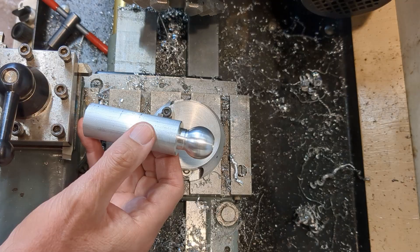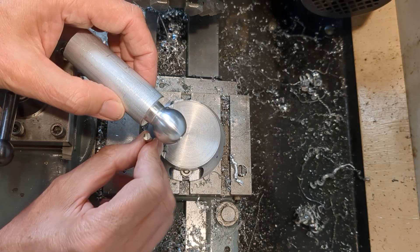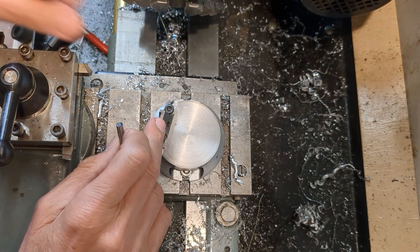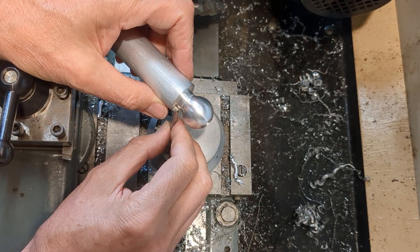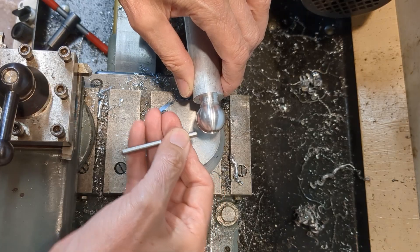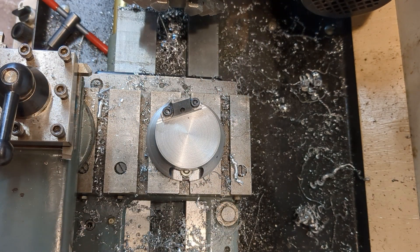What I'm thinking about now is a tangential tool holder — an alternative tool holder to be mounted here where, instead of holding the tool like this, the tool is held underneath. That will enable me to get into much tighter spots. So what I'm going to be looking at in part six is an alternative tool holder that can hold the tool at a suitable angle for tight spots, and also by bringing the tool holder beyond centre, I'll be able to use it not only for turning balls but also for cutting internal radii. I do hope you'll join me for that.